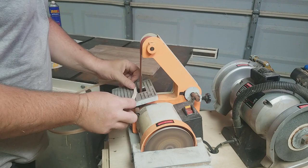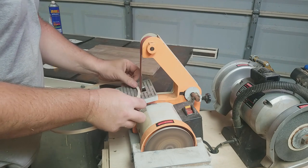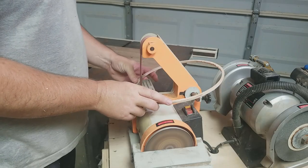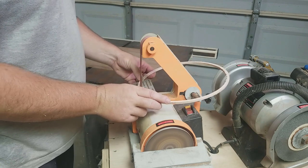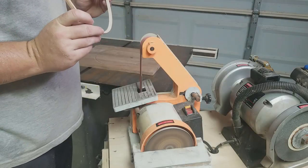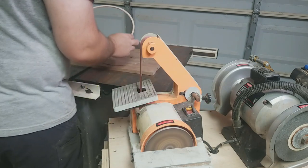To make the ring seat easier, I sanded a slight chamfer on the bottom side. Remember earlier when I said I should have cut the groove deeper? In a couple of places, the chamfer went too high up the side of the ring, resulting in slightly thick glue lines. That wouldn't have happened if the groove was deeper, allowing the thicker top of the ring to contact all the way around.